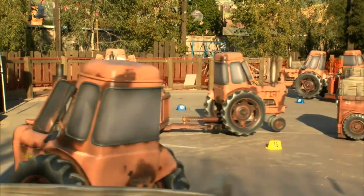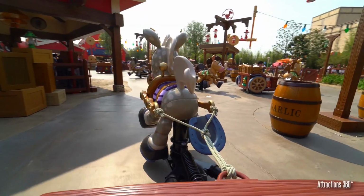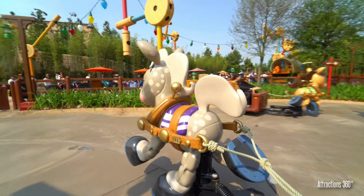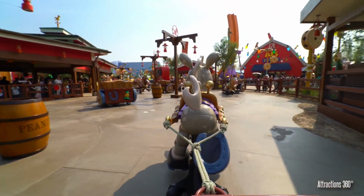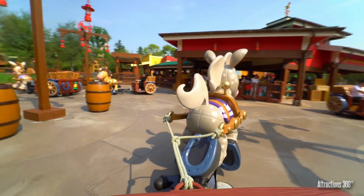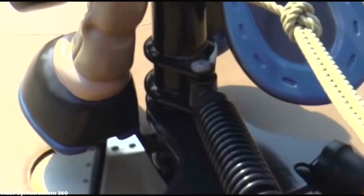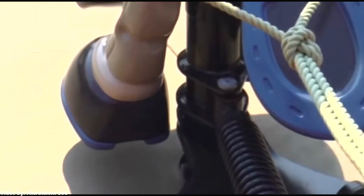Patterned along the edges of the spoke platforms are slotted openings to the basement of the ride. Through these slots, the central support column for the vehicle protrudes up and out. Unlike the spoke arms, these slots will align at the handoff point, forming a pill-shaped slot. The column can then slide over to the other side of the slot before separating. When a slot is not occupied by a column, a spring-loaded cover slides in from underneath and is pushed over when the column slides over.